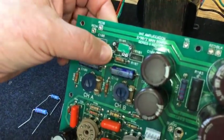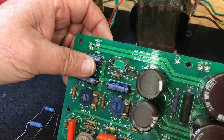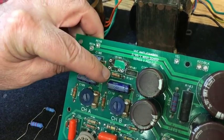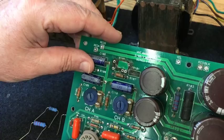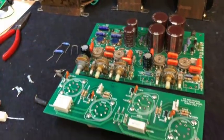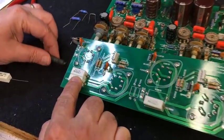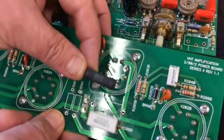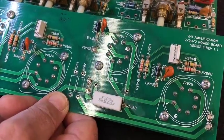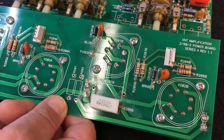As you saw in the previous video, there was a hole burned all the way through this board. We patched the board with another piece of fiberglass to support all the component holes for the parts going back in, and basically got it all ready for the new parts. One of the screen grid resistors was a different type than the others, and since this is a part that operates under a higher load than most, we're replacing it with the original stock value as a matter of course.